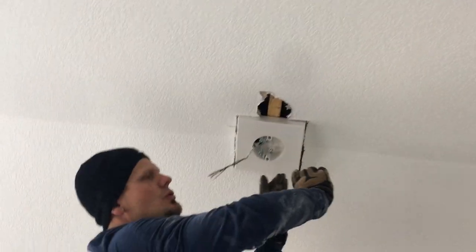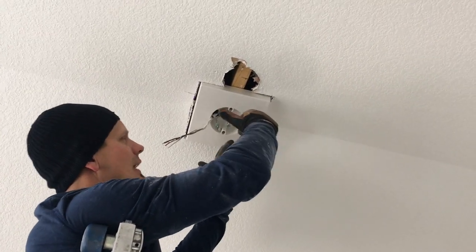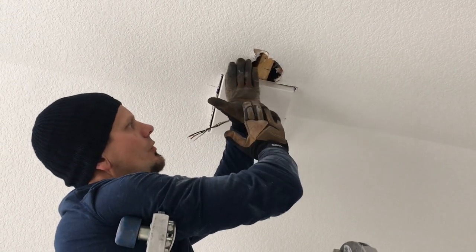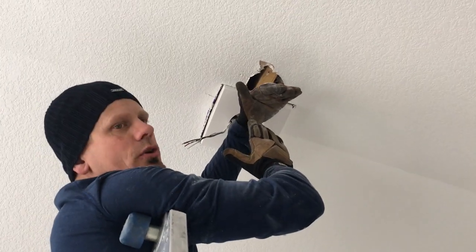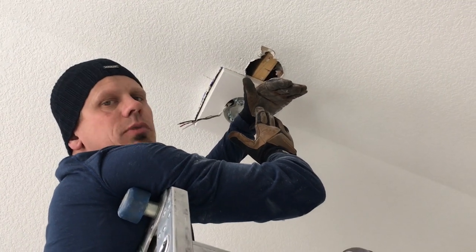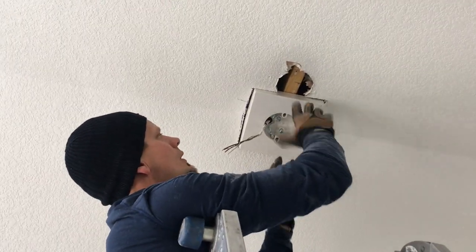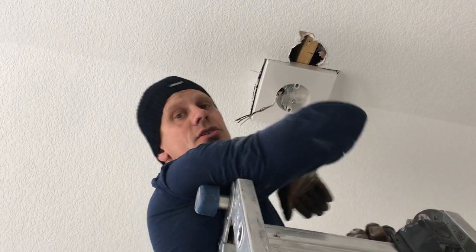This is really nice to do unless you're doing a log home where the carpenter cuts a piece of wood. That ceiling fan has to be flat, so you don't have to worry about that knuckle being at an angle. They do make angled knuckles on certain ceiling fans when you get up to 33-degree pitches, especially with more expensive ones like BigAssFans.com by Haiku, Casablanca, or Minka. They'll have those knuckles you can put in for the box. But this is also a really good way to do it — you do have drywall damage, but there's nothing we can do about that other than get a patch. Thanks, guys.